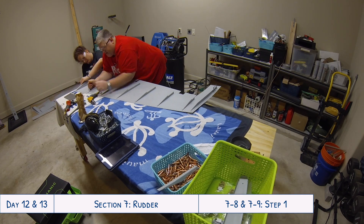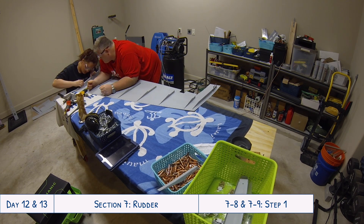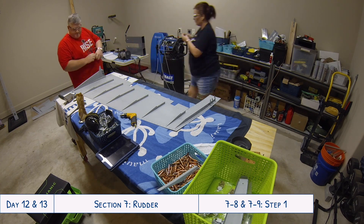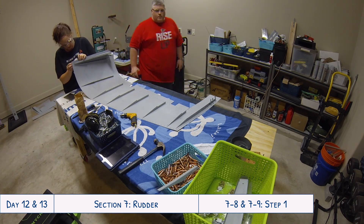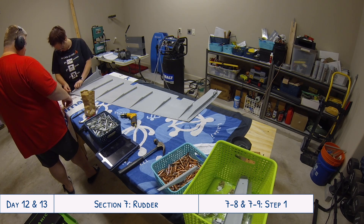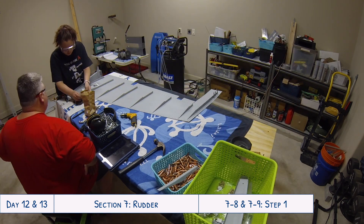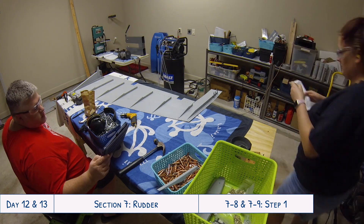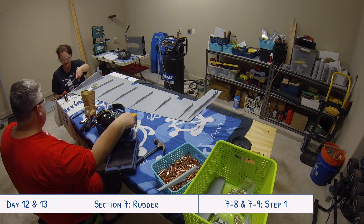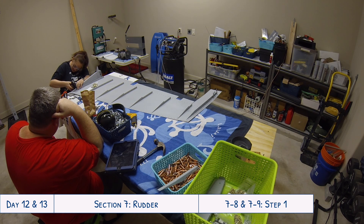In the end we did get it riveted, got the halves put back together, and it looked like it was supposed to with the rivets called for in the instructions - it just took a lot of time, patience, and many different tries. I'd love to hear from any of you who have done this before: what worked for you? Nothing we tried got that rivet installed until we separated those halves to create enough space to back rivet normally. Please leave a comment - it would be good to know for future tight-space situations on the plane.